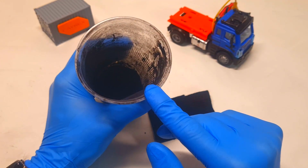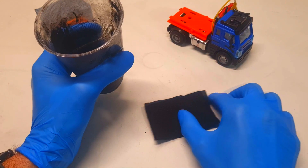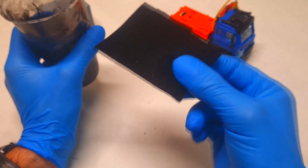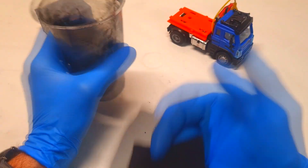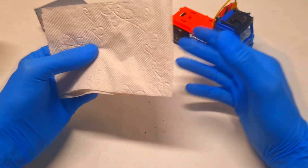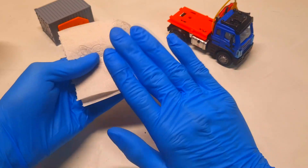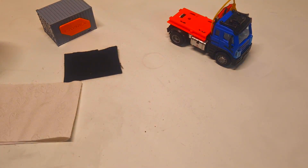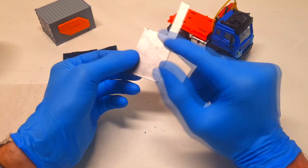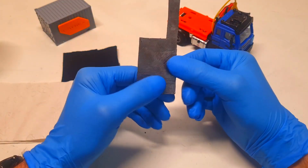That means I add 4 spoons of activated carbon powder and 1 spoon of carbon black or graphite. For this project I will use the activated carbon felt, because using it is a little bit cleaner to make the cell. Then here I have the separator. The separator can be made from kitchen paper, filter paper, or whatever you want — no big deal. The current collector for the positive side of the battery is this graphite, which you can easily find on eBay or Amazon.